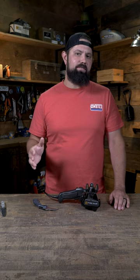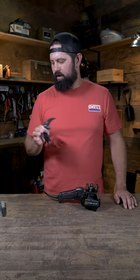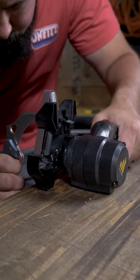A more effective and faster solution is to use a powered sharpener with a flexible abrasive belt, like our knife and tool sharpener here. That flexible abrasive belt will form to the curves in the blade — either on a recurve, or form to that deep curve on your hawksbill or karambit — leaving you a nice factory finish when you're done sharpening.